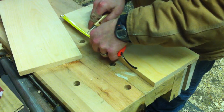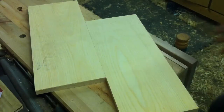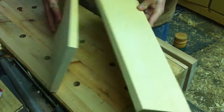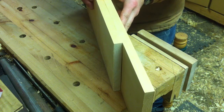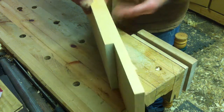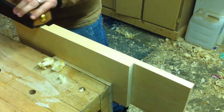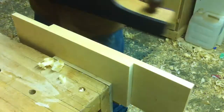Before the glue up, I make a mark six inches up from the end of each board — this is where the joint will be. To joint these edges, I fold the boards away from one another and clamp them in my vise. And with a couple of swipes, you should have two continuous shavings coming out where the glue area will be.